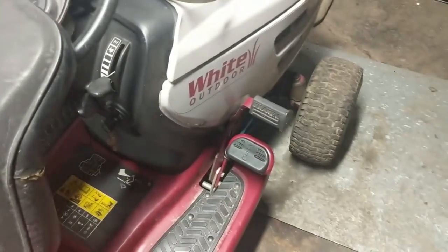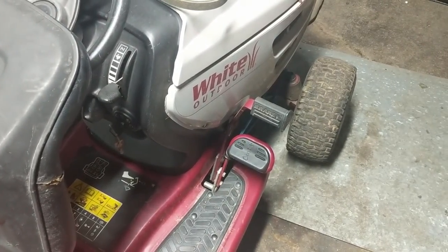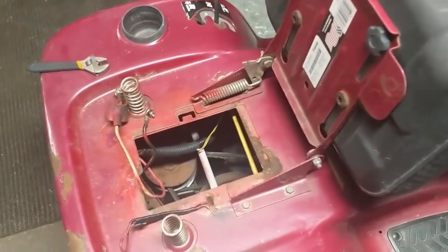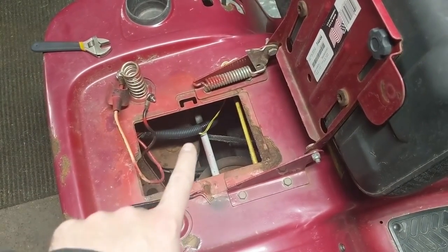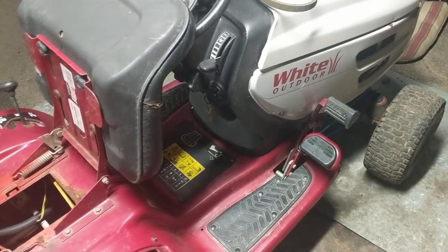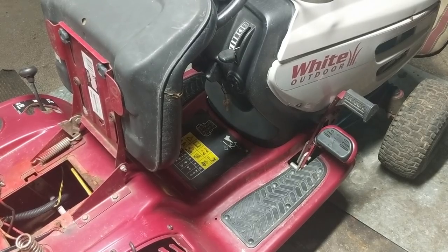As soon as I got that pulley oiled up, I fired up my machine. I put it to about half throttle, and even though the throttle pedal had a lot of slack on it, I put the transmission into forward and slammed my foot as far forward as I could a couple of times. I heard a real loud squeal, and then all of a sudden I was driving — I did a little wheelie and that was it. That's essentially the brute force method of freeing up that pulley. By lubricating it and slamming the throttle with a little force, I was able to rotate it, and once it started rotating that centerpiece started moving up and down on the shaft and the machine was driving again.